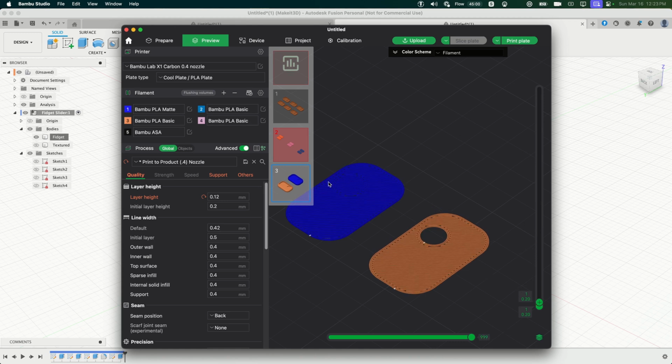This is crucial because if you want that magnetic feel or touch, more specifically the fidgeting piece to the magnets shifting around, you want a very thin layer line here. Now you can make this thicker if you want to, but if you make it thicker, it may not be as strong and the magnetic fidgety feel won't feel the same compared to a very thin layer line.